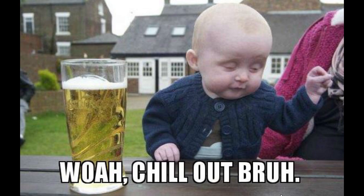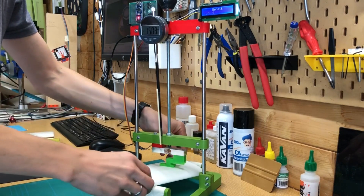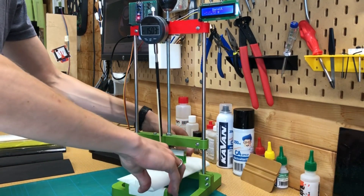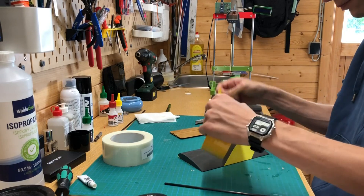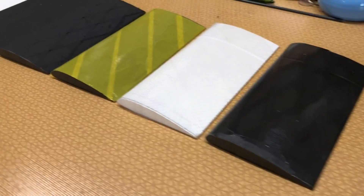It also tends to melt in plain sun when printed in dark colors. Now you may say: dude, stop hating, buy a roll of lightweight PLA HT. Yeah, you're probably right — lightweight PLA HT is much more heat resistant, but it's also much softer than regular lightweight PLA. For this reason I tried some techniques to get stiffer parts out of lightweight PLA which last longer.